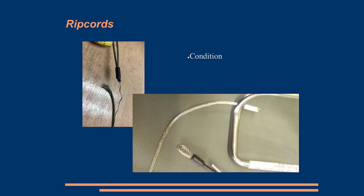And frayed cables — the cable on the left there wasn't how it was originally seen; after we twiddled it around a bit, it ended up looking that way. But there were broken fibres in it. One of the pictures from an Atom isn't a very clear photo, but you can just about make out a fibre on the eye, and the area it's pointing at is where it normally rests on the metal handle — and there were broken fibres there. So basically when doing repacks and everything else, do take the ripcords out. The soft ones can be a pain, so pull them out and put them back in and inspect the whole condition of them.